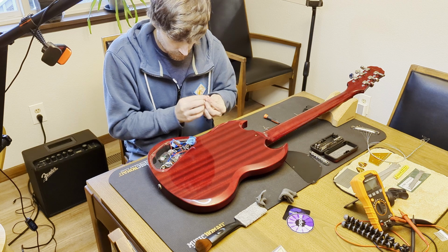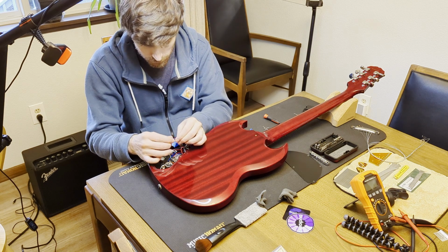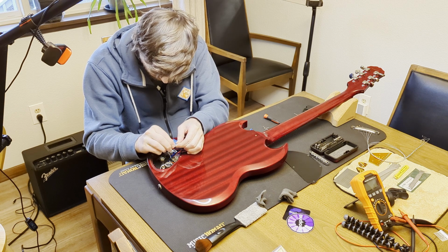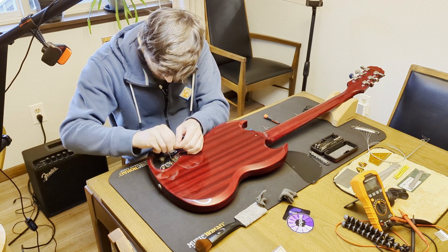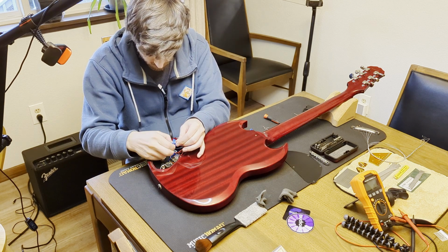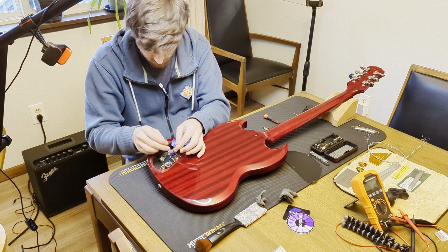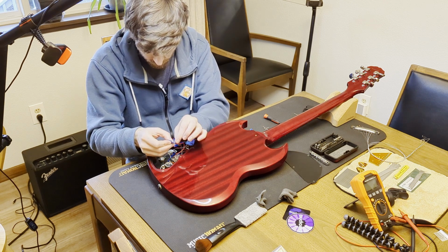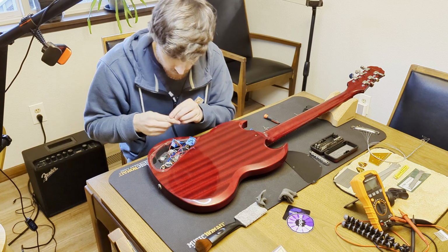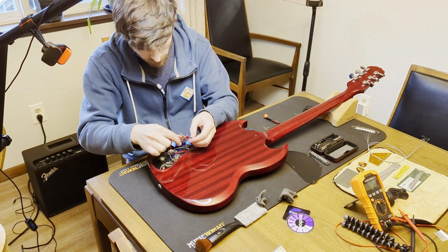There is some heat shrink on that wire that we're going to move up and put over the solder area. I'll melt that down so it's protected. Excuse me. I didn't want to just leave it with painter's tape on there. It was actually kind of tricky to get off. But the solder looked good. Now you can see me moving that tubing up to put it over there. That way we don't hit any grounds or something like that. That'd be bad.